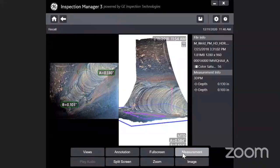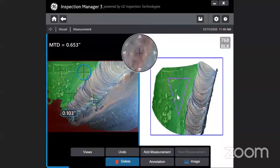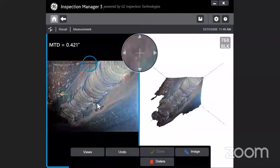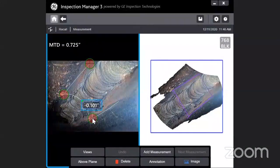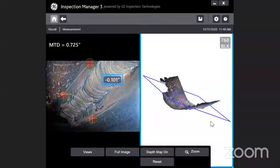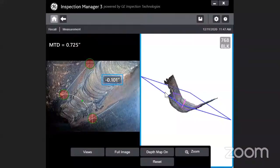In the piping industry, if you want to measure the weld bead depth, we have introduced a new feature within the 3D measurement technique: the area depth profile. With this area depth profile, you place the cursor across the weld bead, and the system automatically places the cursor on the highest point of the weld bead. On the right side is the 3D image, and you can exactly see how the plane looks. This is something very new in the 3D measurement technique — you can measure not only two-dimensional defects but also the weld excess.